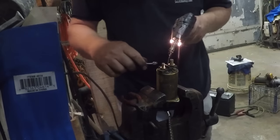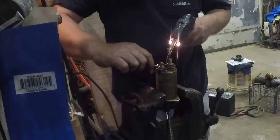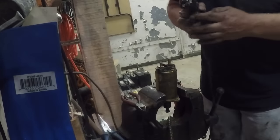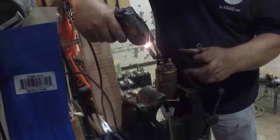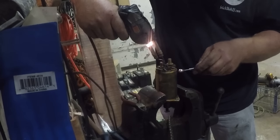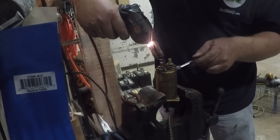I've been heating it to get one side to melt and tightening that bolt down a little bit to get the connector slid over. But I don't want to do it too much because I don't want to bend the cap. So then I have to switch to the other side and heat this one and go a little bit more on this other bolt and keep repeating till I get that cap all the way down. And then I've got to solder these connectors back together. So definitely not a repair friendly system.